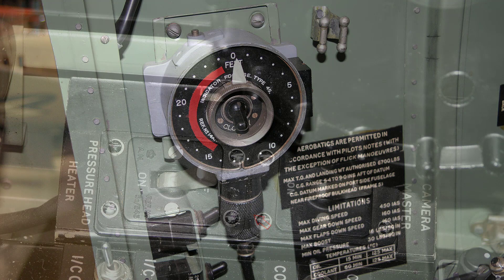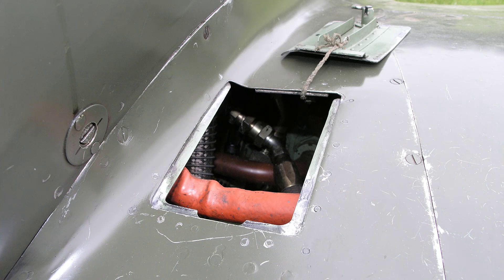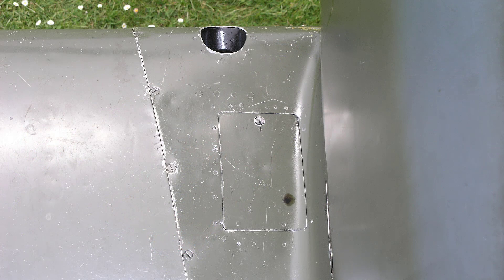The master switch for the camera gun is situated on the side of the fuselage forward of the fuse panel. The air operated switches and terminal blocks for connecting the seven core cable from the camera are fitted to the outside of the shell plating on the port side, and access to them is obtained by removing the section of the root end fillets marked 'electric cons'.